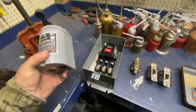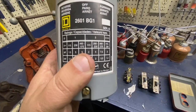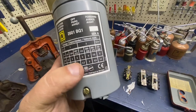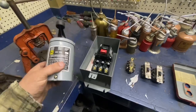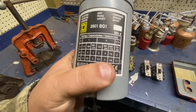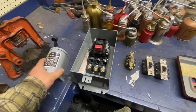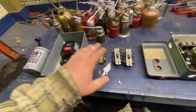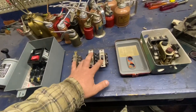There are also drum switches. This one's rated for three horsepower, this one for five horsepower. Remember to use the single-phase rating because you're only running two legs through there — that gives you a little safety factor. I'm not an electrician, but I've been making rotary phase converters for 22 years, so I always play it safe. Your switches can be a little oversized.